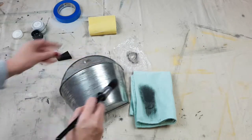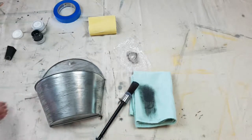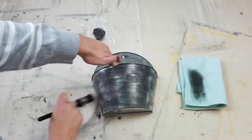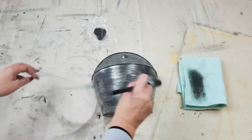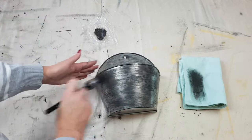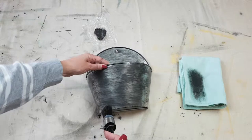I'm just going to let that dry now. That's pretty much it for the Fusion Ash — we won't need that anymore. I did let that first coat dry but I wasn't quite happy with it, so I've gone a little heavier again with the ash, just popping some more on without even dipping my brush in, and I've gone back over the whole entire piece again. We will be distressing so that will dull it back a little bit.